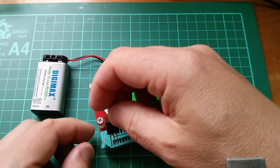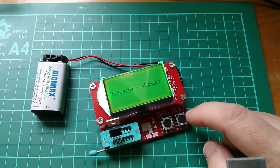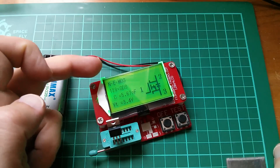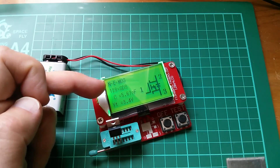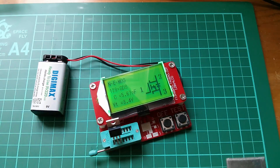So I'm going to put this MOSFET in there now. I think you have to put it in positions 1, 2 and 3. Let's try that. So that's telling me it's an N channel enhancement mode MOSFET. Pins 1, 2 and 3 are gate, drain, source. The gate capacitance is 5.67 nanofarads. I assume that's the threshold voltage at 3.4 volts — so at that voltage it starts to conduct, although that won't be when it's fully conducting. And then it gives you a nice symbol of an N channel enhancement MOSFET.